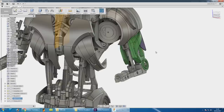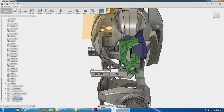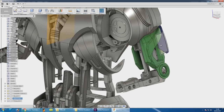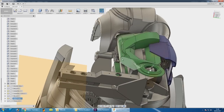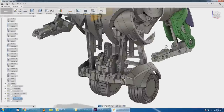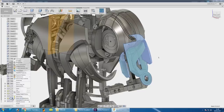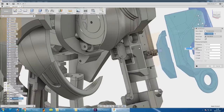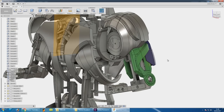I've designed some bicep and tricep pieces for Ultron, shown here in blue and green. They're a bit unusual looking because they have to fit around the mechanics of the arm, so they're not quite like Ultron's, but they'll do. There's a scoop on the side for the tricep muscle. These have to rotate as the arm rotates — that rotational axis is the big gear here — so they'll need to fit under the shoulder bell. They're going to mount onto the piece that holds the motor to pull the bicep up, and that part rotates around as the arm rotates.